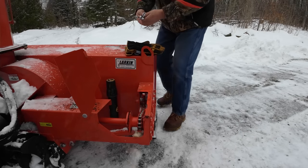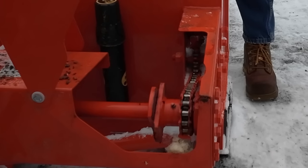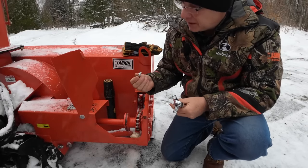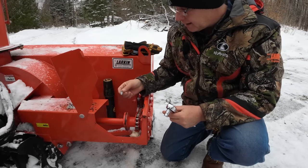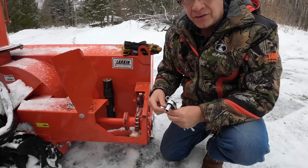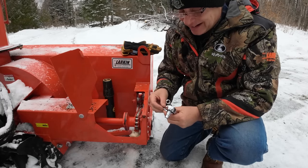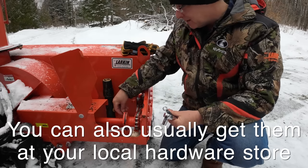It's pretty simple to line these back up. You just want to turn the auger until you get these guys where they're supposed to be — and they are. Remember, on this blower there are two different size shear bolts. There are bigger ones in the front. The ones on the fan are the same as this one — they're smaller. I believe it's page 35 in your manual where you'll find the part numbers for those shear bolts. If you haven't got spares, I strongly recommend you get a bag of them. I don't buy two or three, I buy an entire bag.